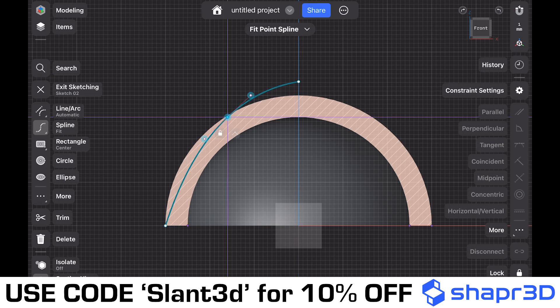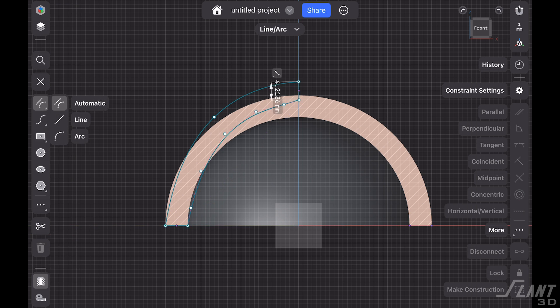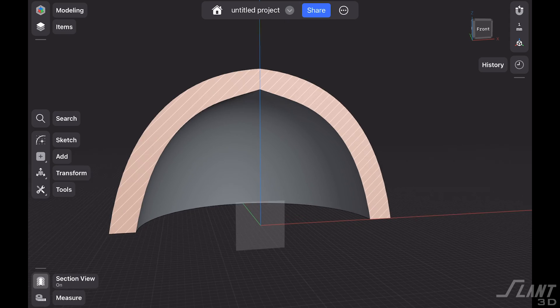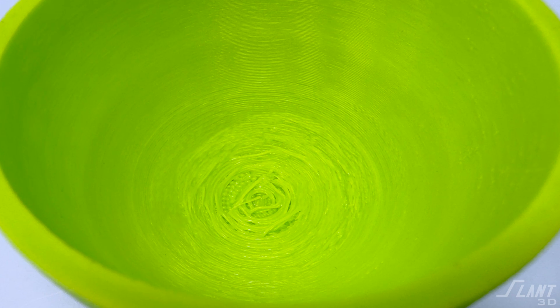The first thing you can do is change the design of the dome itself a little bit — make it more egg-shaped. Pull up the top just a little bit and also taper the inside so it comes more to a point than it traditionally would. That way you get away from the flat overhang and bring it up to a tighter point so that dragging can be reduced inside. But this can require quite a bit of stretching to make it disappear entirely.